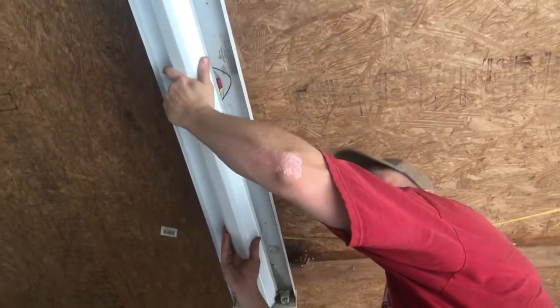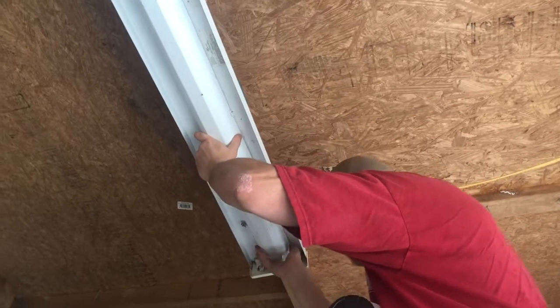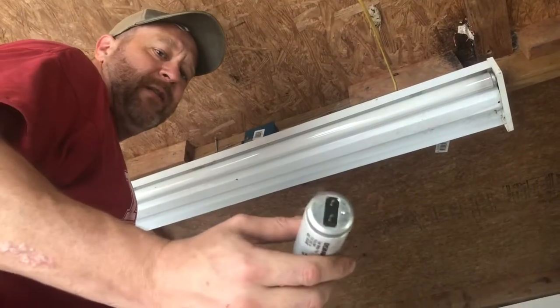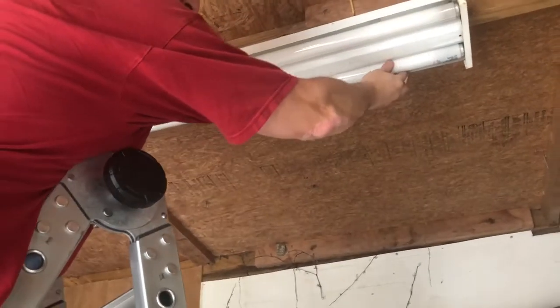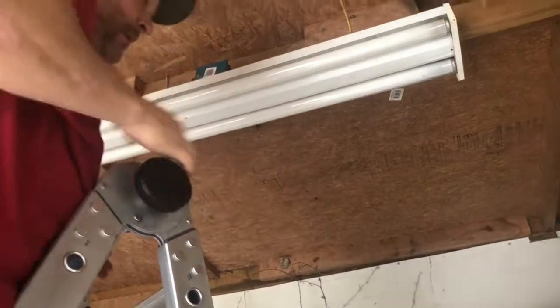Maybe the hardest part of all this is putting this cover on to cover your wiring. Just make sure the wiring is tucked inside the cover - it goes on a little set of tabs and you just snap it into place. A newer fixture will be easier than this old one, but this one's really not too bad. Now for the bulb: make sure your pins are oriented up and down. As they go into the tombstones, put them both in on one side and then give it a quarter turn. Should be pretty easy. Ta-da! The light works.